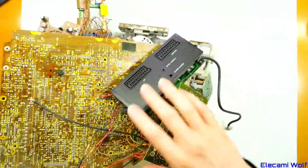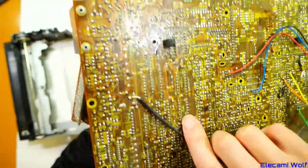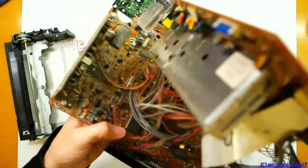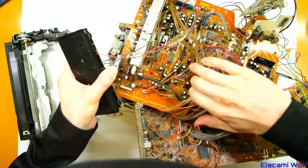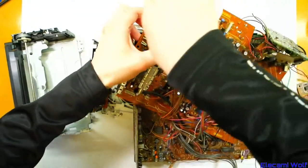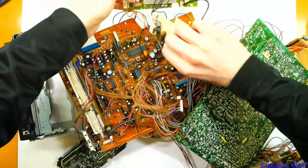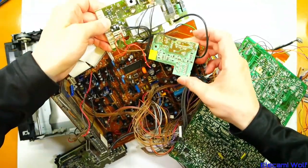What it has is one of those early version plated-through boards with the little green-looking through-holes. But you can see in a lot of places there are marks — that's the juice that's leaked out of the electrolytic capacitors. It's flowed through holes in the board and it's just corroding everything. The machine is completely wrecked — there'll be capacitors leaking all over it. This machine was extremely complicated with a lot of extra boards that looked like afterthoughts.